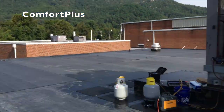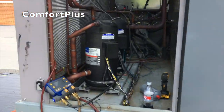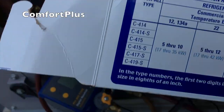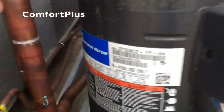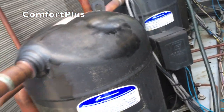It's a beautiful day, Saturday morning. I don't want to work here when there's kids around, so we'll save this job for Saturday. But if you look at the size of that dryer, it's only a 16 cubic inch dryer. And if you look on the box here, 16s are good for maybe up to 6 tons, and they've got it on this circuit with these two 103,000 BTU compressors in tandem.